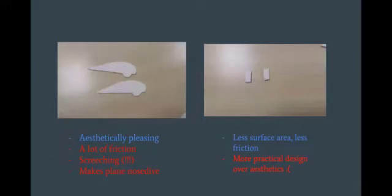We also experimented with different types of undercarriage of our plane. We first went with a design that was shaped like a landing gear to enhance our design. However, we soon found out that this produced unnecessarily large amounts of friction with the ground while taking off, causing it to nosedive. We swapped the bases of the undercarriage with small flat pieces of styrofoam, sanded with sandpaper to make it as smooth as we could.